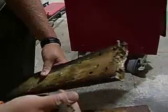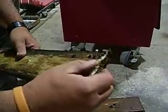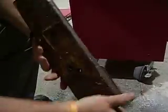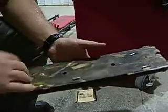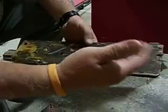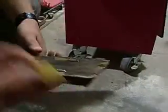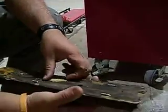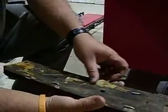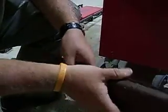I don't know what they gnawed that out with — whether that was a beaver, a groundhog, or raccoons. We took it out in two pieces. This piece actually lifted right off; it had been epoxied down to the old keel, and the epoxy had hardened and all the shaking had just split it right apart. There was no bonding at all — here are actually some pieces that just flaked off. So there was no bonding at all with the epoxy, and probably all the vibration is what did that.